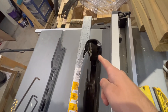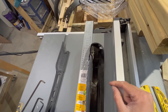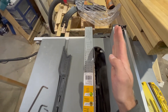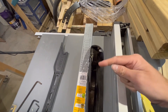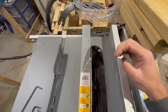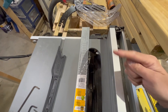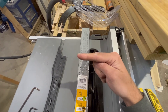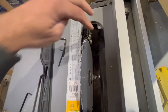With the two four-millimeter bottom screws loosened, get your two-millimeter allen key and go anti-clockwise, which will let the riving knife travel back to the left to straighten it out. Remember: anti-clockwise — lefty loosey, righty tighty — pushes the riving knife to the left, and clockwise pushes it to the right. I've gone back and forth a few times getting it perfectly lined up.